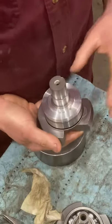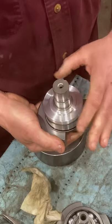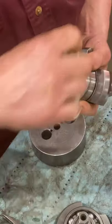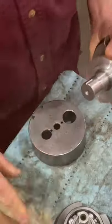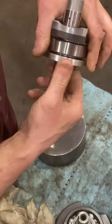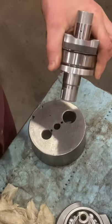This isn't actually touching the collar — it's riding on little molecules, like little ball bearings of oil. To demonstrate how close this seals but yet does not touch, I'm going to hold it upside down momentarily and spin it a little bit. Now there's oil inside of this seal.